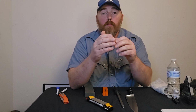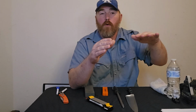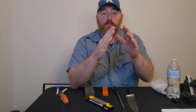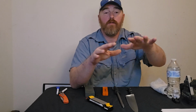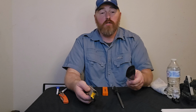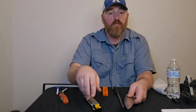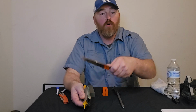All right, so all those jagged edges, when you are pushing that metal in a certain way and you're stropping it or sharpening it, you're trying to get those jagged edges as consistent across the edge and as flat of an edge as you can, but they're always going to be jagged edges. Powdered metals are better because the grain structure of that metal actually has less jagged edges along the edge. I know that's neither here nor there and too in-depth, but what you're doing when you're stropping is you're trying to finish off those jagged edges and get them all in one straight line, like buffing it out.